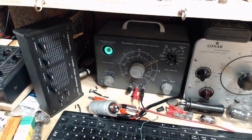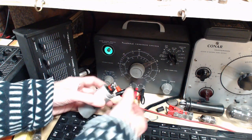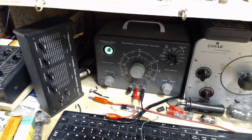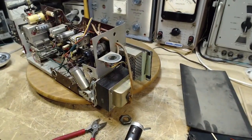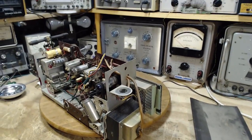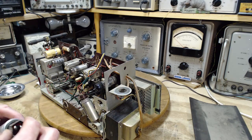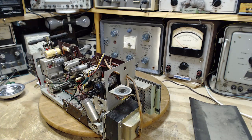I think the test in the radio is actually valid. The radio's humming. Really, why is it humming? It's got to be humming because of this. So in a sense, what I'm really doing is I know I have a bad capacitor, and I know whatever readings I see on that instrument are the readings of a bad capacitor. So I can learn. You bad capacitor, you.